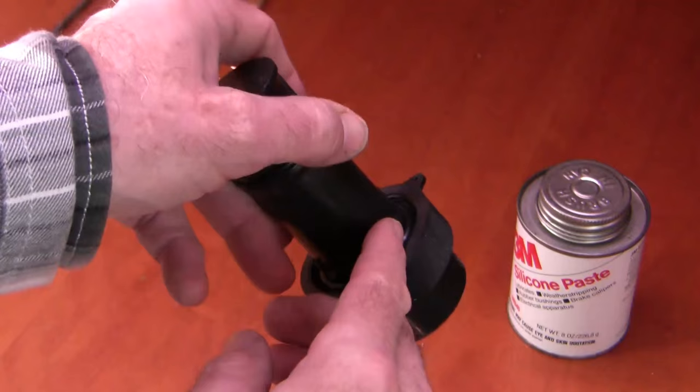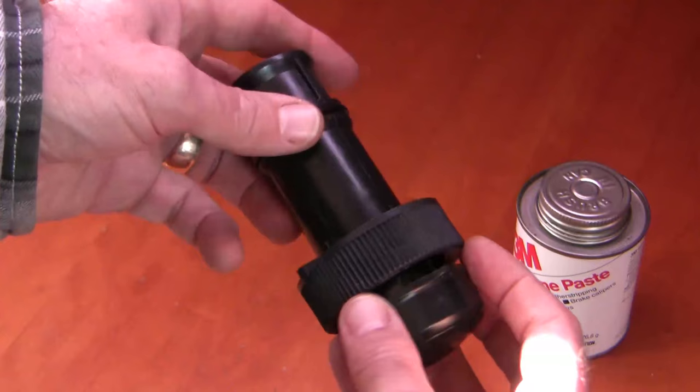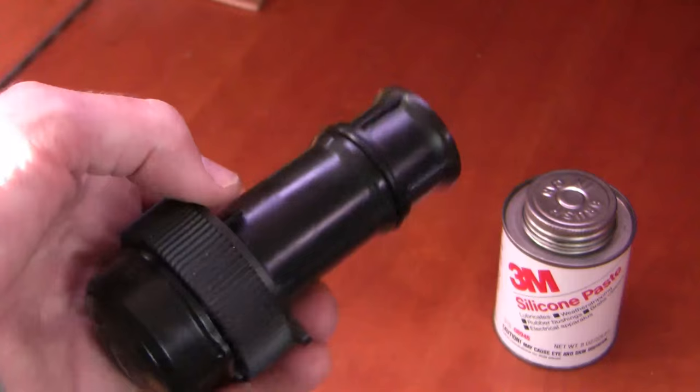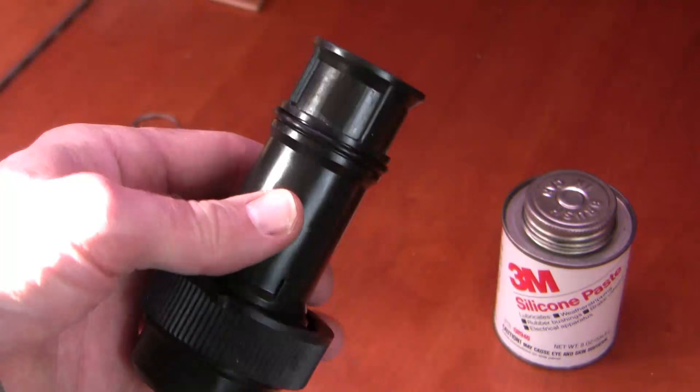The whole thing looks to be pretty good. Now once you've got it clean and free of debris, you can very carefully use some sort of silicone to try and keep this clear and prevent micro leaks. If there's any issue with the o-rings, particularly splitting or cracking, don't hesitate to replace them — they're cheap and easy to replace, and it's a much safer alternative to do it now with the boat up out of the water.